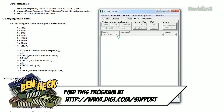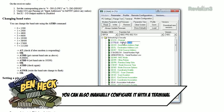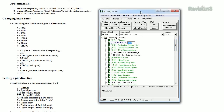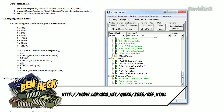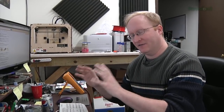We've got the XBee plugged into an XBee Explorer, and we can use a program called XCTU to read the XBee through the Explorer. We plug it in, select the correct COM port, and hit Read on XCTU, and it will show us the parameters. We're going to give it its own identification number so the two can talk to each other and no one else. For the settings, we want to use the wire settings where we have virtual wires — so four pins on the transmitter are interconnected wirelessly with four pins on the receiver. On the Adafruit website they had a great example of how to do this. On the receiver, we need to set the data to number four, low, output enabled to disable. This means it's going to be receiving commands and externalizing them — if the transmitter sends a one, this one will show a one; if it has a zero, this one will show a zero.